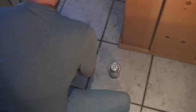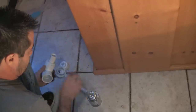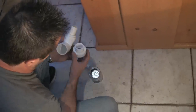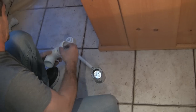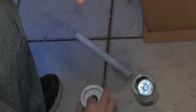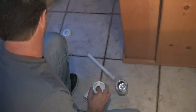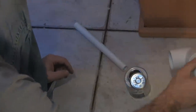Don't forget to put the collar on the union before you glue it on there. Where's my one-inch union? Right here. I kind of lost you a little bit there. The other one's the return line? Yeah — I mistakenly put the glue in the three-quarter inch for the return line. So I figured since it was already wet, even though I've got extra knuckles, might as well do that.